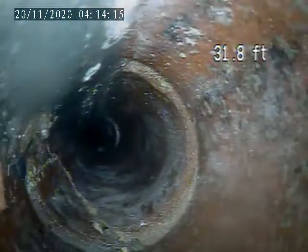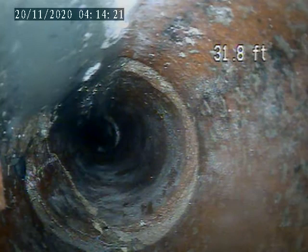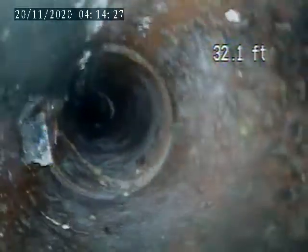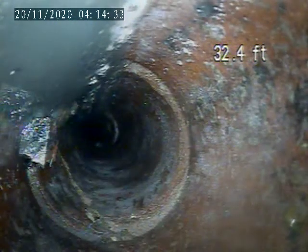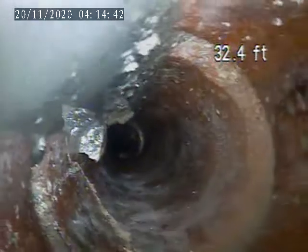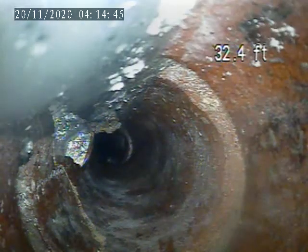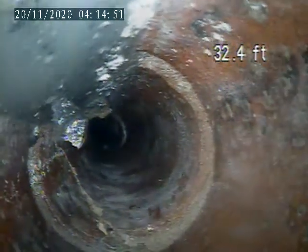Right here, roughly 32 feet on the right side of the pipe, which is on the left portion of the screen, there is a crack in the pipe right here on the side right after this one joint. There's even a section of pipe kind of hanging — it's broken and just hanging right there on the side. There's a piece of terracotta hanging there, and you can see the crack going from the bottom up to the top of the right corner. There's a small piece of pipe that's just hanging out right there too.